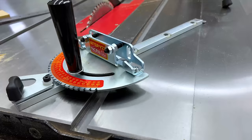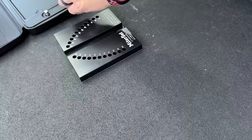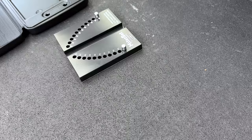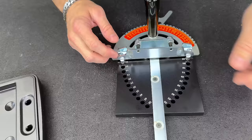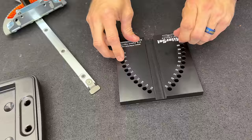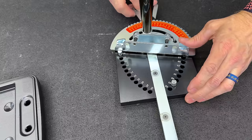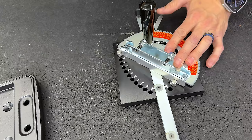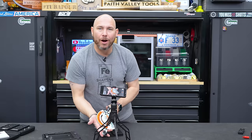A lot of the cheaper miter gauges that come with table saws are really terrible. For setting a perfect 90 degrees: just set it in the miter slot, run your gauge up to it, loosen it off, make sure both sides are touching, then tighten down your miter gauge — perfect 90 degree angle. For 45s, same thing: put one pin on the 45, one pin on the zero, push until both touch, lock it in place, and you've got a perfect 45.